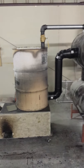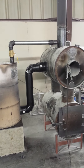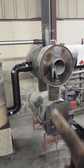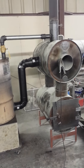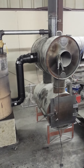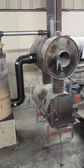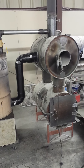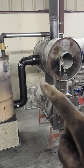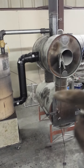So here's what I got. This is my existing waste oil furnace, which is 180,000 BTU an hour. Burns one and a half quarts of oil — waste oil, diesel, kerosene, whatever you throw in it. It gets very hot. The heat blasts into a box, goes to the back of the tube, comes up to the secondary burn chamber, swirls around, goes back through, and it just keeps circulating like that.